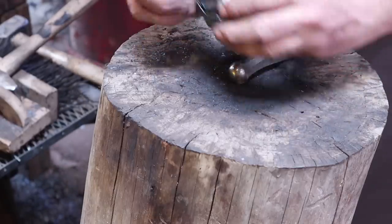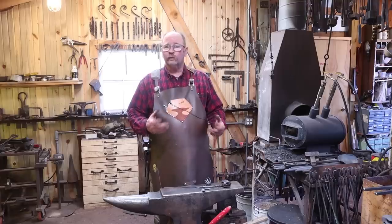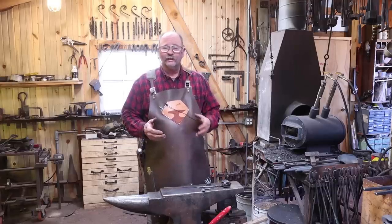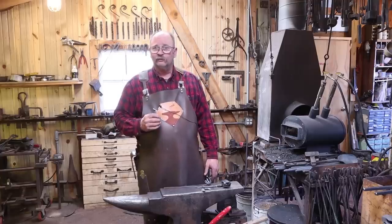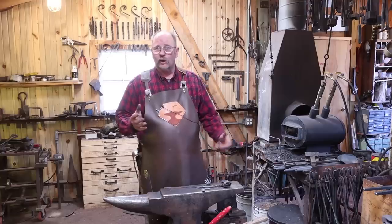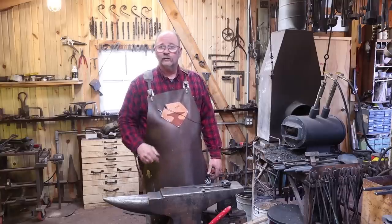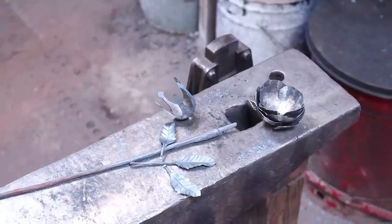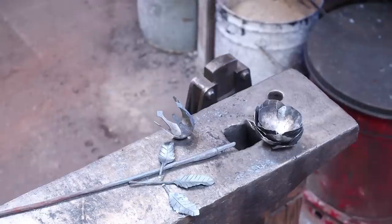So those will all go in there. That's all of the component parts for our rose: we have a stem, three leaves, the sepal, and a set of three petals for a medium-sized rose — and these are fairly lifelike-sized roses. From this point on, it's pretty much all torch work and maybe a little bit of filing — we probably won't use the forge for any of this. An oxyacetylene torch comes in really handy for doing these little tiny welds. But if you've got a TIG welder, you could probably do them with that if you're good with it. I prefer to weld with a torch. So we'll go ahead and split this video into two parts — we will pick up the assembly in part two. If you liked the video, give it a thumbs up, hit that subscribe button, make time in your day to get out to your shop — but stay safe and wear your safety glasses. See you later.